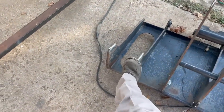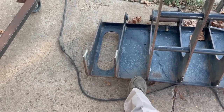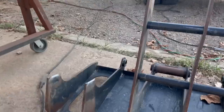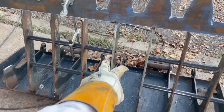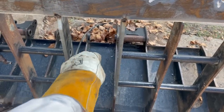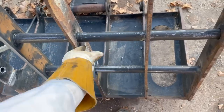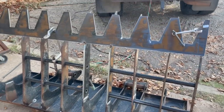I had to take these two off to get my bars in, and I noticed before I ever started that this is bent — because the quick-connect thing behind here stops here, so it's bent back a little bit, and that threw off all my holes. I've got a full section of pipe, full section of pipe, but it wouldn't go all the way through because it's tweaked right in here too. So I'm just gonna put a short piece in there and a short piece in there, and I'm gonna weld all the way around all of these — from the factory it only had like two welds on one side of the bar with nothing on the other side.